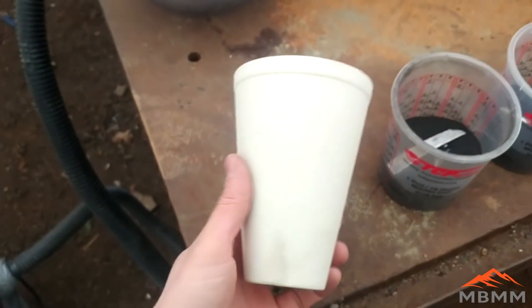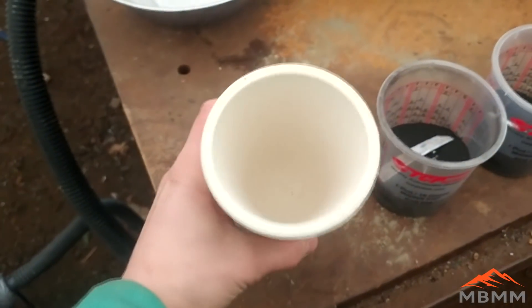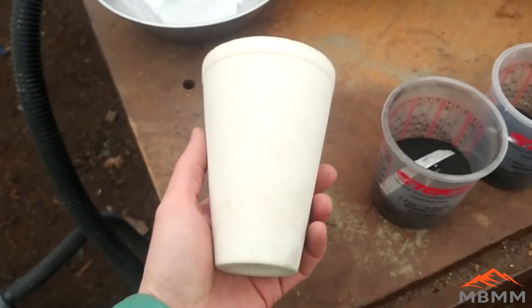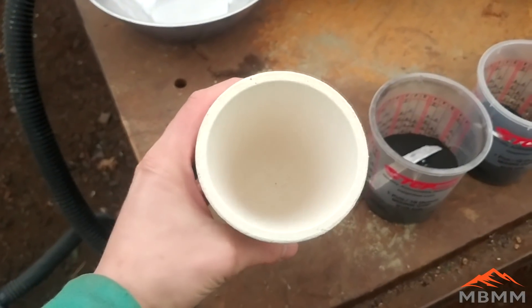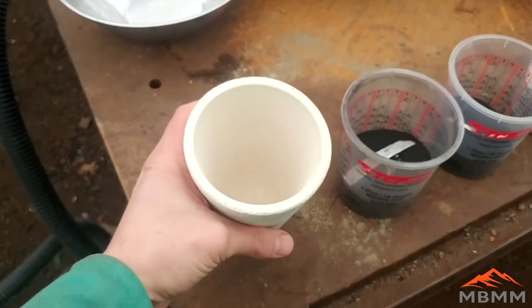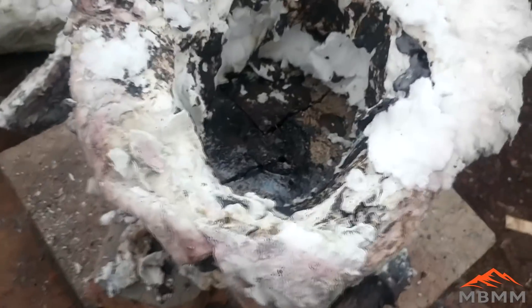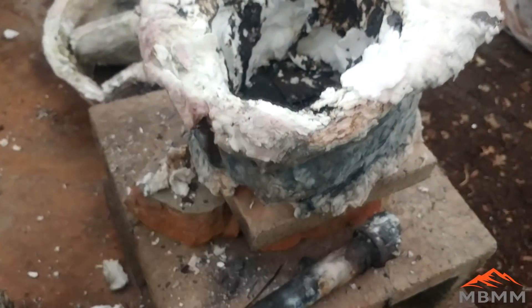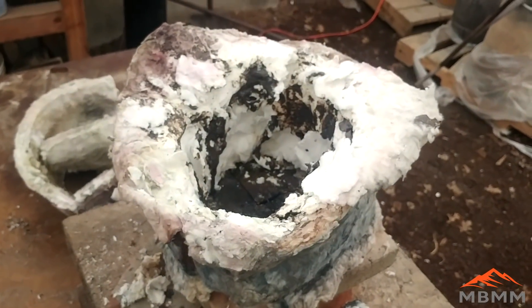Here's just real quick — these are the crucibles I use. I don't remember the size, I think they're like a number three or something, but they can hold the 300 or 400 grams of stuff we're going to be putting in them, and they've been working real well for me. I get them from Legend Refining there in Nevada — I'll put a link to their website in the description below. And here's our sad-looking little furnace. This is just a wrap of kaowool, and I put a lid on top. It's seen better days — I've gotten over 100 smelts out of this thing. When it gets so bad it won't hold the heat, I just cut out a new piece of kaowool and put it in there for replacement. The kaowool holds up really well and it's really cheap.